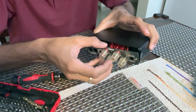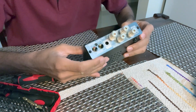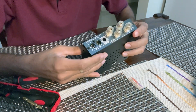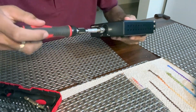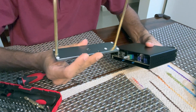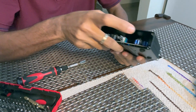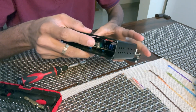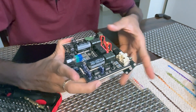The back panel is off. Lovely gold-plated connectors — good quality connectors here, no doubt about that. This is the chassis plate and the amp should come smoothly out. Take care not to damage it with any static — probably hold the chassis, don't hold the PCB.